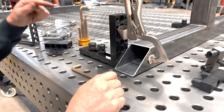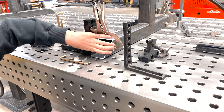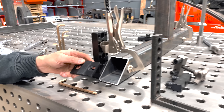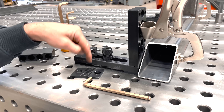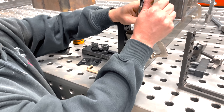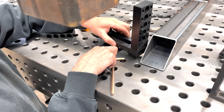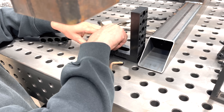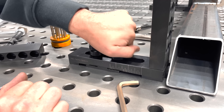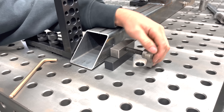This is a good solution if you have fixtures with an infinity slot, to side clamp this way. But the cool thing about the Fireball clamp is it has these teeth on the washer. By placing this washer underneath the fixture, we basically eliminate any of this play altogether and we can push all we want. So by putting this washer down underneath the teeth, placing a fixture in there, dropping it in place, and lightly using the bolt — now let's push as hard as we want.